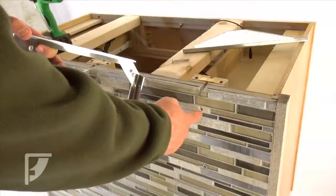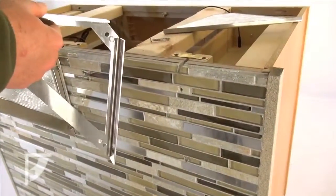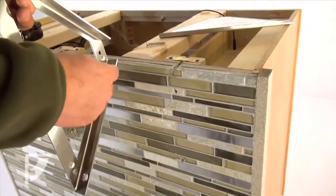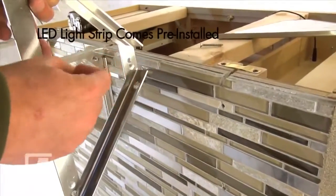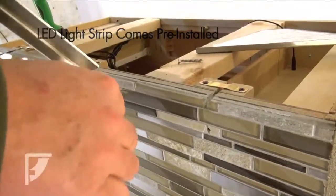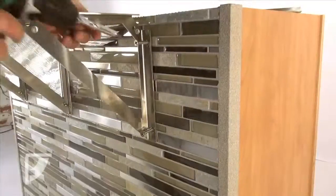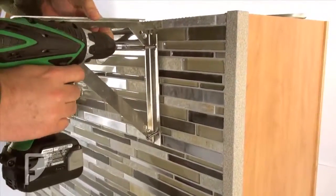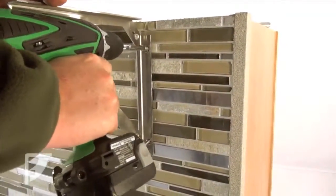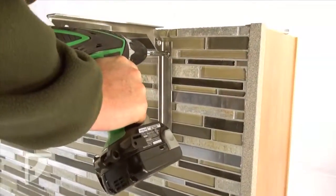As previously mentioned, we have pre-drilled our holes for fastening on our Luminati bracket. You'll also note our mounting holes. These are 1/4-inch mounting holes that are countersunk so that a flathead wood screw will be flush with the surface of the metal. We're going to use a drill with a Phillips head bit on it, and then we're going to really jam it.